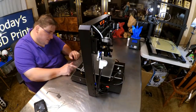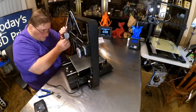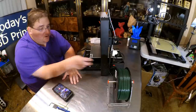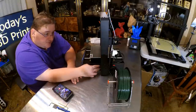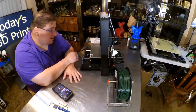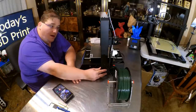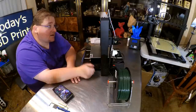I went around and checked every single nut on the machine to make sure it was tight, then it was time for power up. Went through a preheat, got the filament set up, fed it through the filament runout switch, and then we can get going. The printer is assembled — the process was quite easy for the most part. These screws, four on each side, are a little hard to line up. You have to play with the gantry to get the hole to line up because it doesn't thread unless it lines up — you do not want to strip them. Most bolts were tight; QC was pretty good.